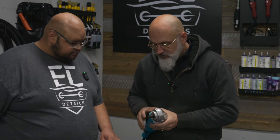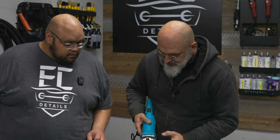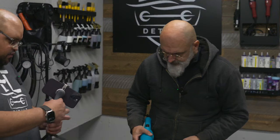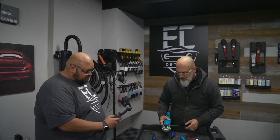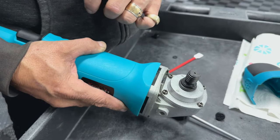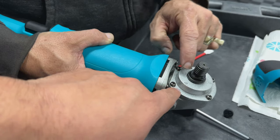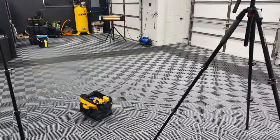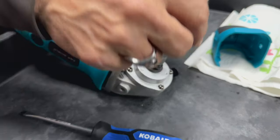The next step is to separate the gear case into two pieces. Generally the gear case will have four screws at the top. I want to make sure you guys can see these four screws right here. When those four screws come out, I'll put a little scratch mark so I know I'm putting it back in the right orientation. This one actually has three divots, so we only have one possible orientation — those three little marks ensure we put it back correctly. Anytime you take tools apart, mark the orientation before removing screws.